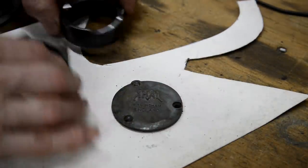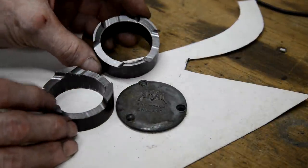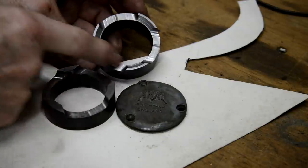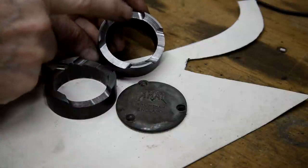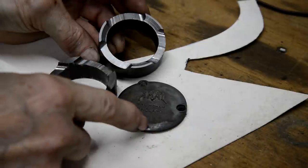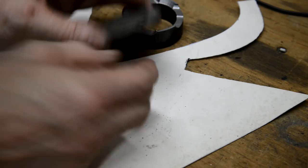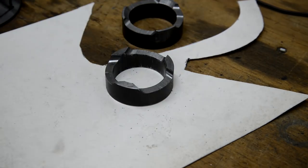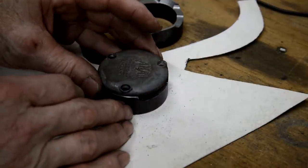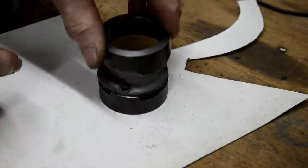he shows you a tool which I made. He says with alloy tube, but anyway. What it is is two rings with three pieces cut out on each ring. Now this ring I've actually chamfered at 60 degrees, which is roughly what the curve on the edge of this is. So what happens is you put that like that, you put that on there like that, you put that on there offsetting these pieces.